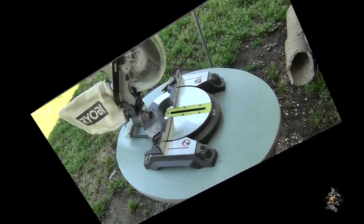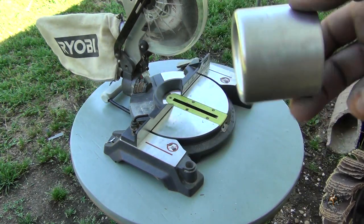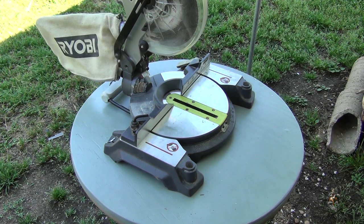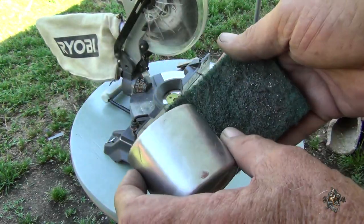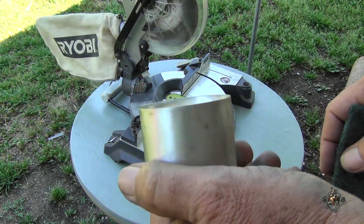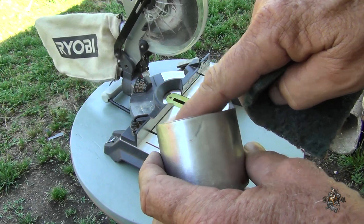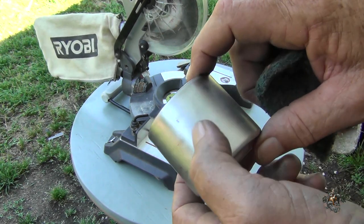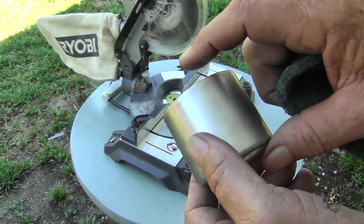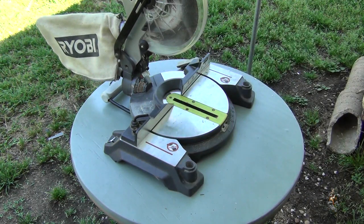I took this and got most of the paint off it — the reason I did that is so I could actually see my marks when I go to make the holes around it. Then I took some Scotch-Brite and rubbed it real good and got the rest of the paint off. Now when I put my marks on there I can find where my holes are — it'll be a little easier. The top is smooth, nothing rough in there. I also checked the roundness and found it was a little high on one side, so I leveled that out.